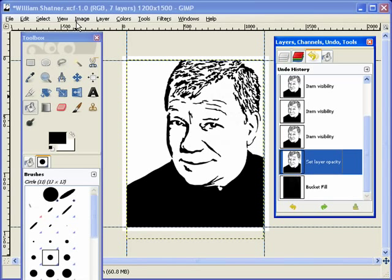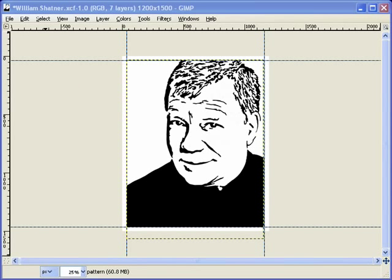Go ahead and go through your pattern with a fine-tooth comb. Look at all those little lakes and peninsulas and make sure that everything is supported with one another. If one of those peninsulas is a little bit too long and needs a bridge somewhere, just add a little extra support for when you're cutting and handling the actual project. Go through with a red pen, circle everything that will pose a problem, go back to your pattern and fix those problems. Once we're done, you pretty much just print it out, glue it to your material, and just go at it.